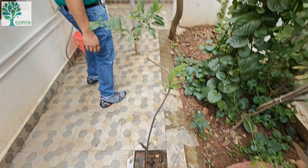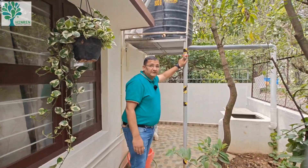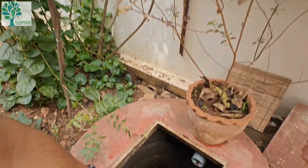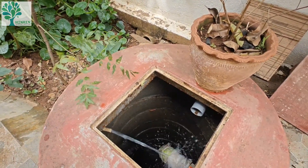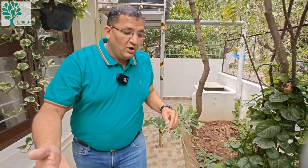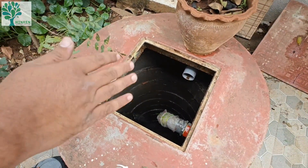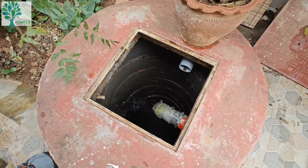Also, if I want to clean the sedimentation tank, I have a valve here — if I open it, the water from there starts coming back again into this recharge well. Similarly, if it is raining and the sump is full, the overflow from that sump also comes through this pipe into the same recharge well. So this unconfined aquifer receives the water and it gets into the soil water.